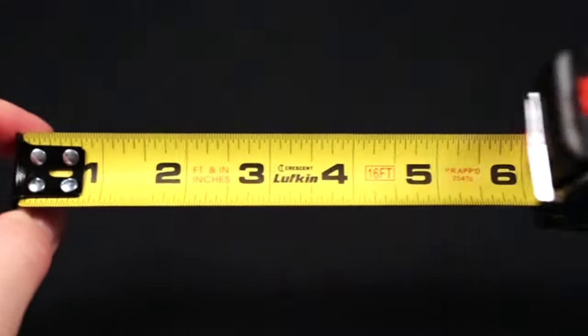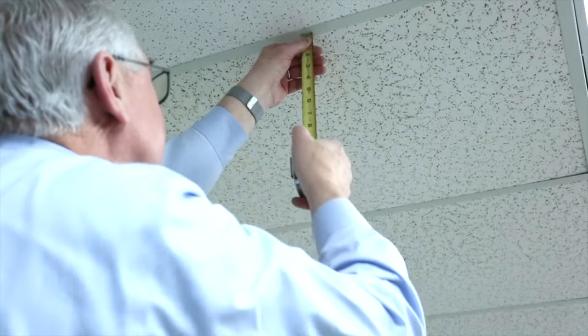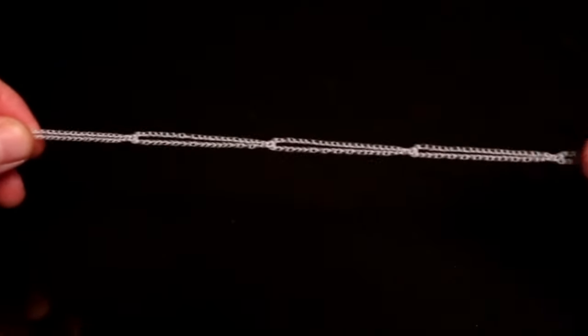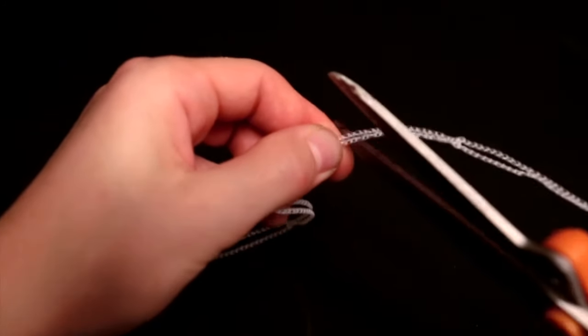The key measurements you need to determine the length of the loop line connecting cord are the ceiling to desktop and height of the pass-through from the desktop to the bottom of the Sneeze Guard. Subtract these measurements from the height of the guard to arrive at the length of loop line. Round up or down by 2 inches or 1 loop and cut loop line with scissors. Cut each line with the same number of loops.